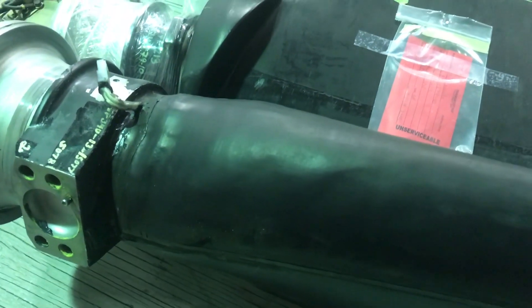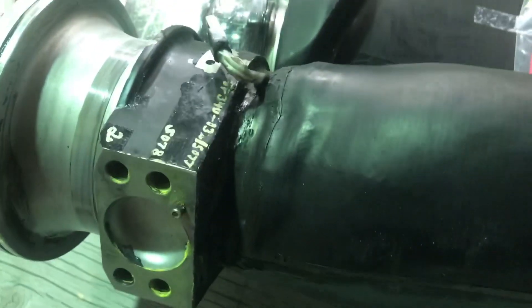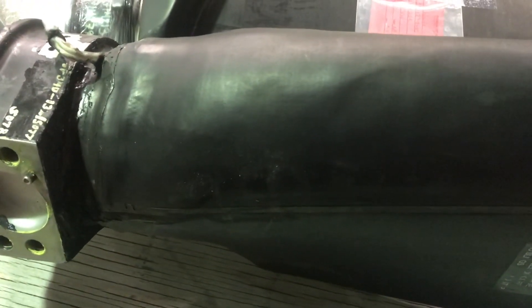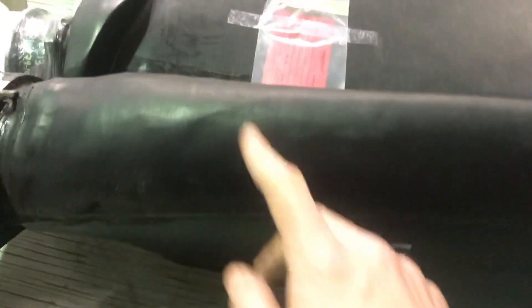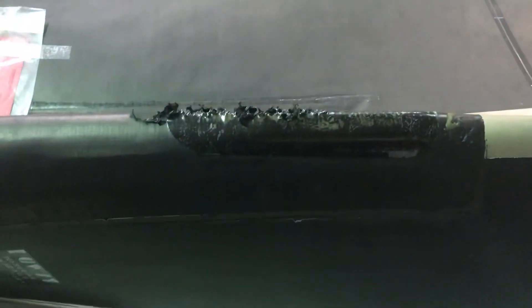They are kind of a pain for that. If you don't use Bostick, typically you'd use 1300L, which is kind of a common glue, and it's a lot more forgiving. But that being said, 1300L doesn't stick quite as well. But I've glued many blades with 1300L and I've never had a blade come off or anything. Personal preference — I prefer that, just for the simple fact that if it was Bostick on this thing, just taking a blade boot off can be a real challenge.